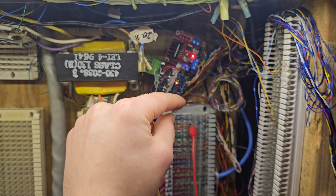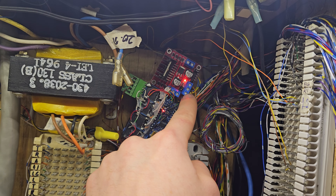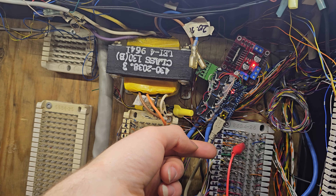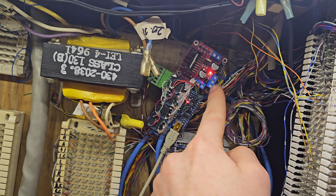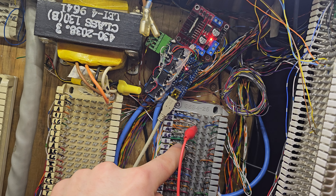I've not finished the program for it yet, but I think I have made a fully working circuit at this point. In my last video I detailed sort of what these connections do, but I'm going to go over them again quick. Priority hold is just a system that was developed by Western Electric Bell System, and it would create a special winking flicker pattern going at about 12 interruptions per second. It required two specialty line cards: one was a special flutter generator and the other was a supplementary hold detector.